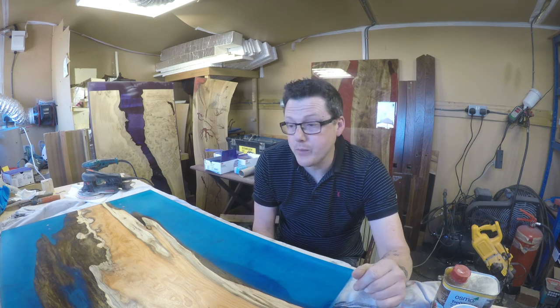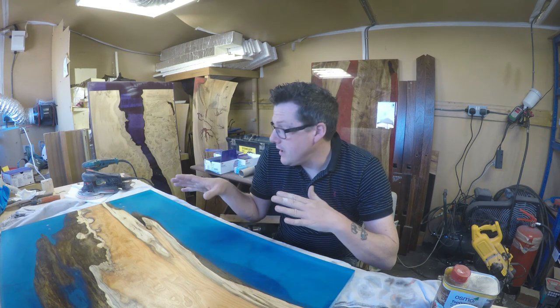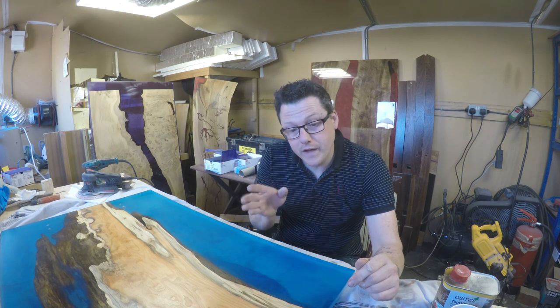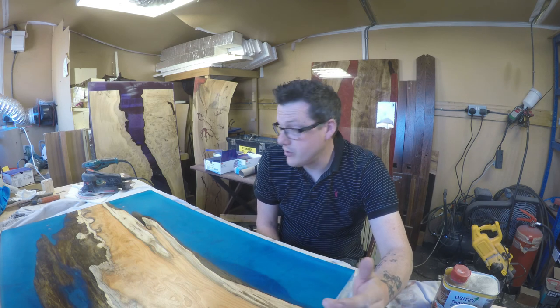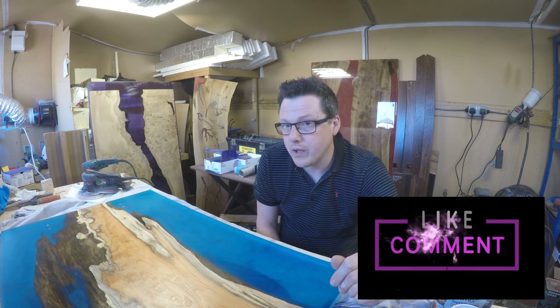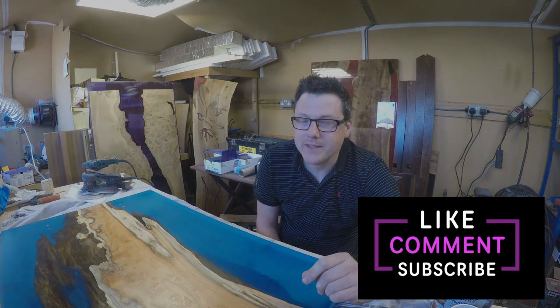That's it for me now. I'll be doing more of these videos — hopefully a polishing one next. Just to quickly say: the sanding itself on just one grit was just under half an hour, so that will give you some idea of how long you need to spend on each grit to get the best possible finish. The Osmo application itself is actually really easy — that's the shortest time period — but make sure you prep first and it will go on lovely. Thanks for watching and I'll see you again next time, thanks very much, bye.